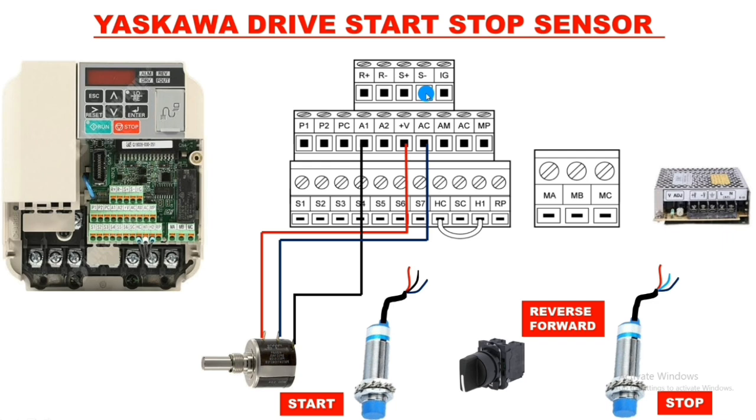For sensor DC supply we connect one SMPS. First connect line and neutral to the SMPS input terminals. For the sensor connection we use plus and minus 24 volt DC — these come out at the plus V and minus V terminals. The red wire from the SMPS is positive, so take one connector from the positive terminal for plus supply.